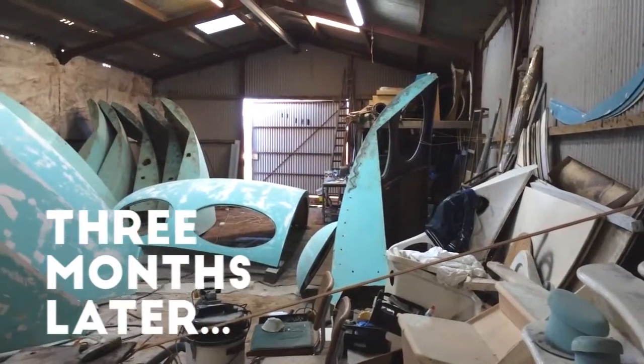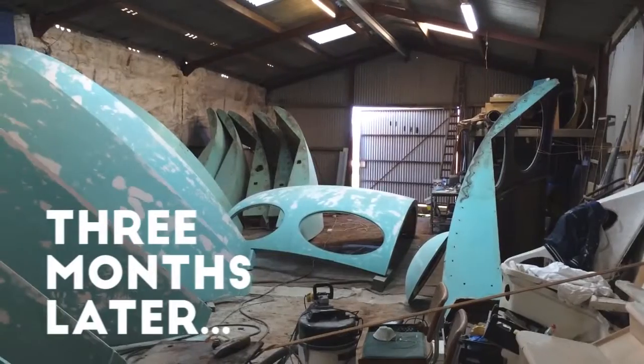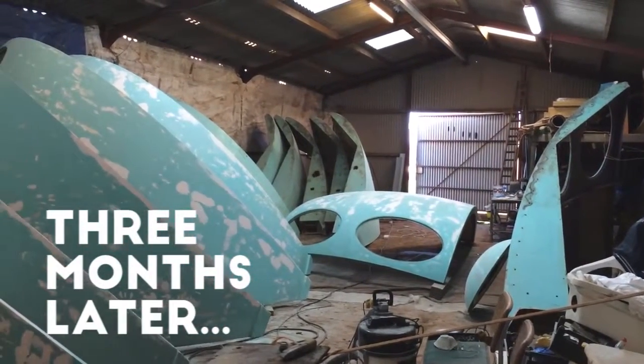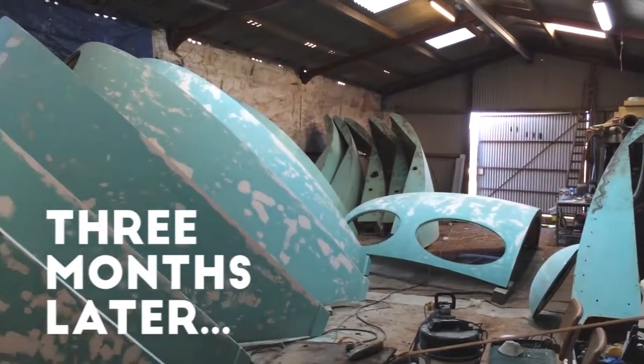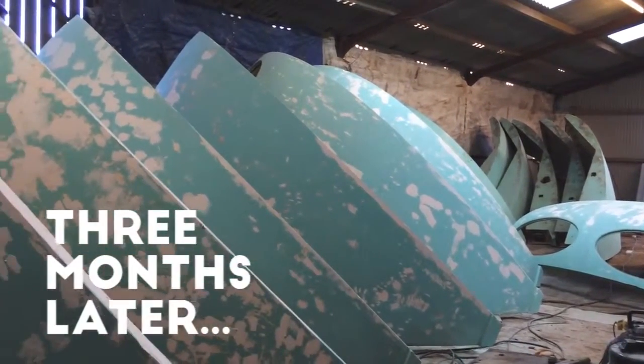It's the middle of March. I'm in the process of taking out all the mildew infested pieces of fiberglass top coat, which is meaning quite a lot of filling, as you can see. So a little black pinprick or something slightly larger, a few millimeters big, when it's opened up with an angle grinder will become maybe 2 centimeters diameter.